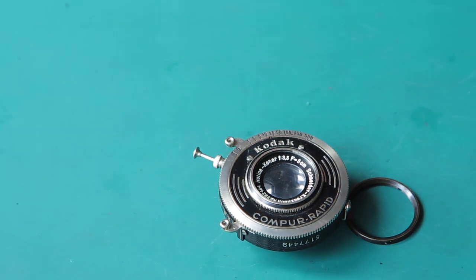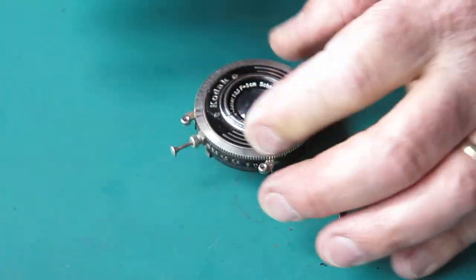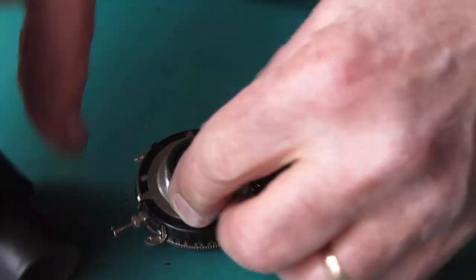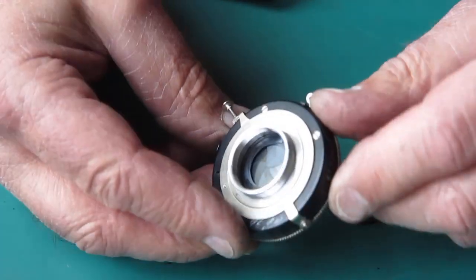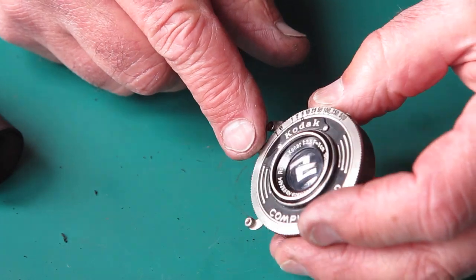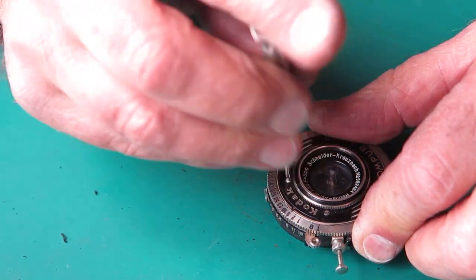Getting the lens off the back could be entertaining. I'll need a friction tool. Friction tools like these are great things to have — they allow you to unscrew stuff that's well stuck without having to get spanners and things onto them. This does not want to move. Let's try the rear group. Oh, that's loose. Now I can see a bit of paint around the thread there — that was probably on the retaining ring. Some helpful person put that there to lock that. This front one doesn't really want to come off. First I'm going to remove the name plate because it sits up slightly proud and I want to make sure my friction tool is not catching on that.